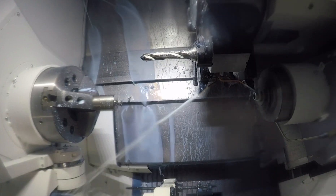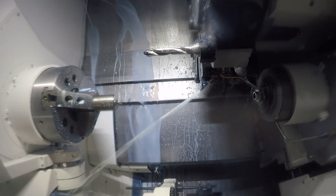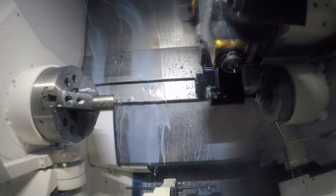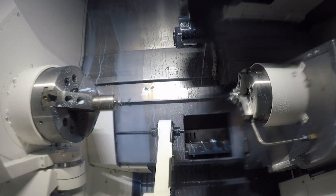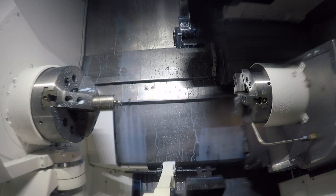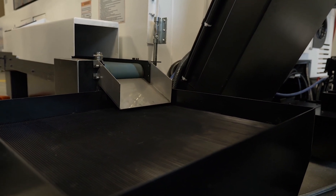Keep in mind that you do have milling capabilities on the second spindle also, though we don't show them here. The parts catcher should come up after we finish the boring operation and we'll catch the part into the parts bucket. The parts bucket will then unload it to the conveyor, which will then exit the finished product onto the parts table.